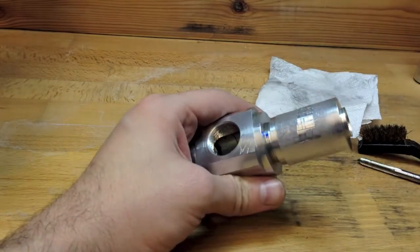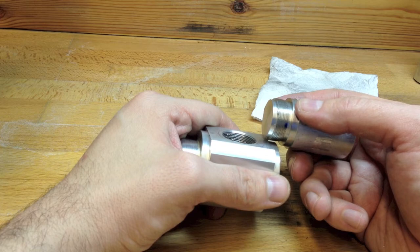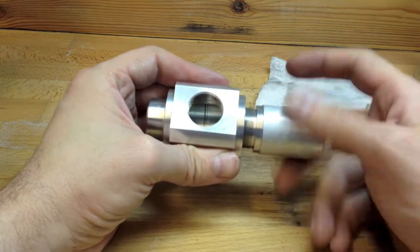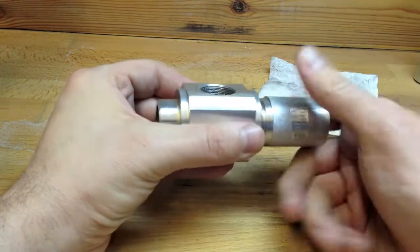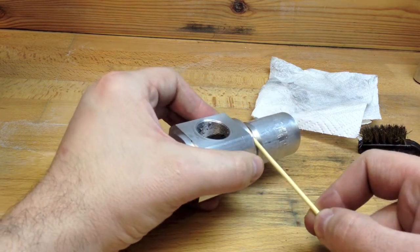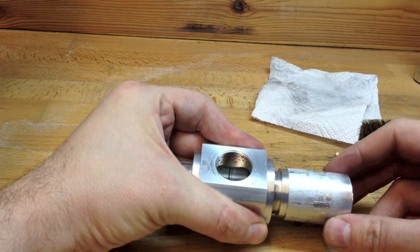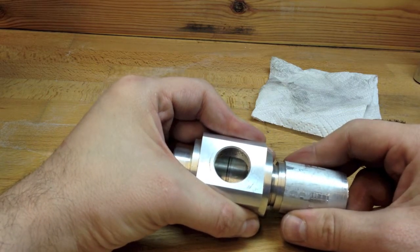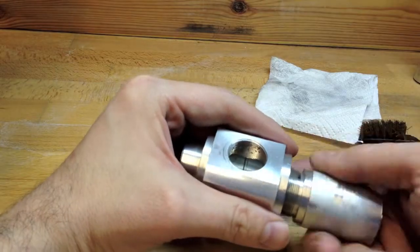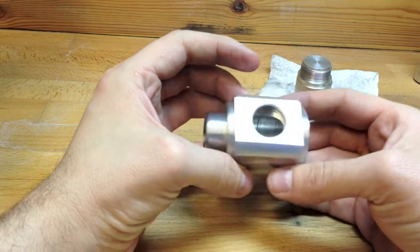I've just made a little pen marker. We're still only going as far as those damaged threads. Really, these threads are not a precision surface — the whole idea is that it is the register between face and face which gives you the precision you require. A thread like this will never present ultimate precision because there's always a tiny amount of free play. In an instrument of this type, that represents a massive departure from precision.